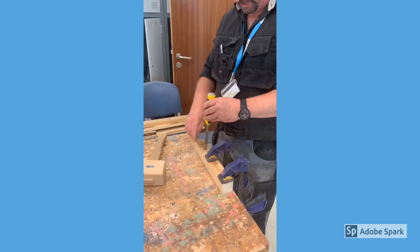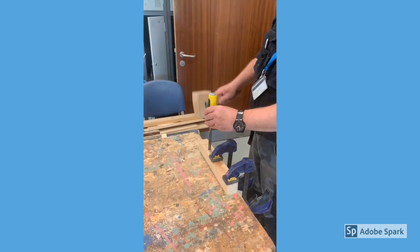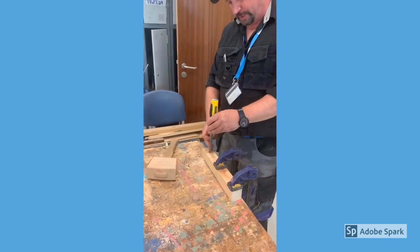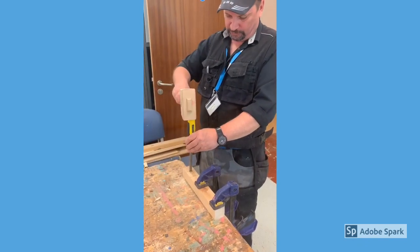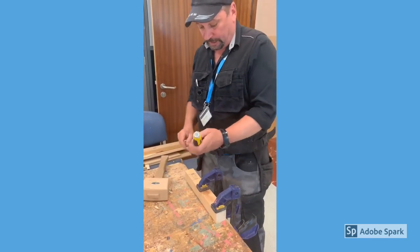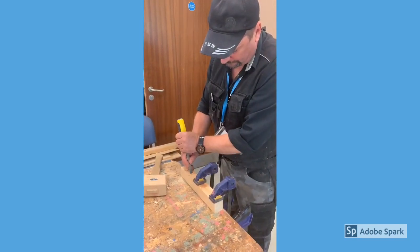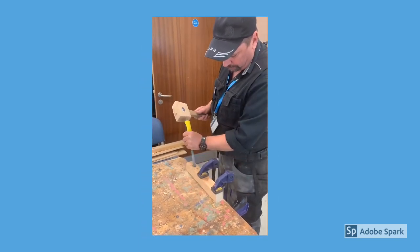With the chisel, it will bounce back to the line. Hold the chisel straight, two taps with the mallet. Bring it around to the far side — flat part of the chisel one millimeter from the line, strike it twice with the mallet and it'll bounce back to the line. Next, hold the chisel so that the flat part is facing upwards but at a slight angle, strike the chisel twice, and pull forward and the piece falls out.